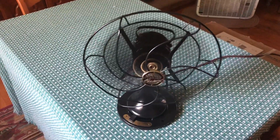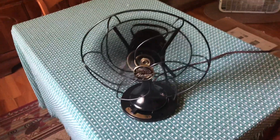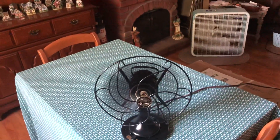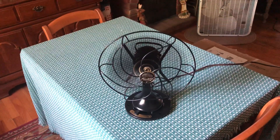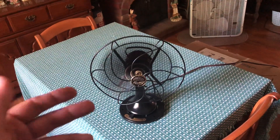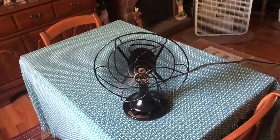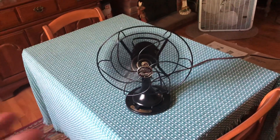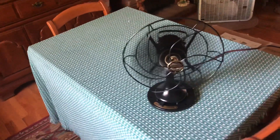So pretty dangerous. What's going on is that the neutral conductor in the head wire — which is actually still original on the fan — is making contact with the metal parts of the motor. It's an easy fix; I just have to replace the head wire. It's definitely the neutral, not the actual hot leads causing the issue, because the fan still runs at two distinct speeds. If both leads were making contact they would short against each other and the fan wouldn't run correctly.